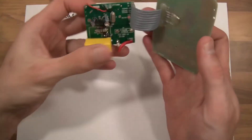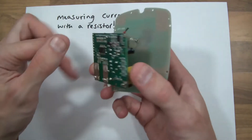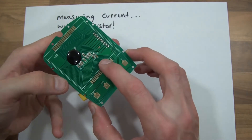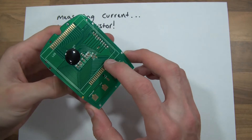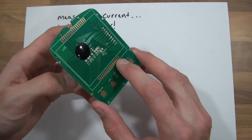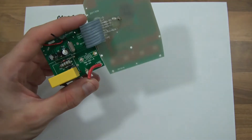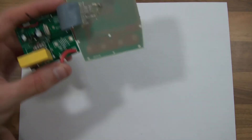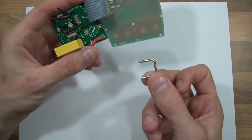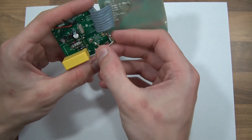Just before I start, this is a wall meter — a wall monitor or energy monitor, whatever you want to call it. And this is actually the inside of one. So you'd plug this thing into the wall and it would have a display here, an LCD, and it would show you the voltage of the power and the current being used. And then voltage multiplied by current equals watts, so it could tell you how much energy you're using. The way this thing works is by using a resistor — I actually pulled it out. It's a very low value resistor. This resistor here doesn't actually look like a resistor, but it is. It's called a shunt resistor, and this is how this little device measures current.